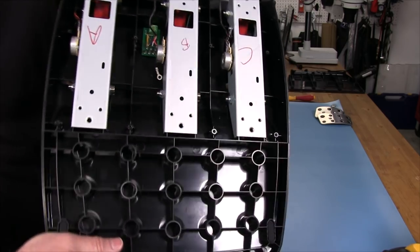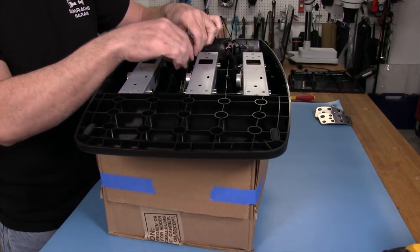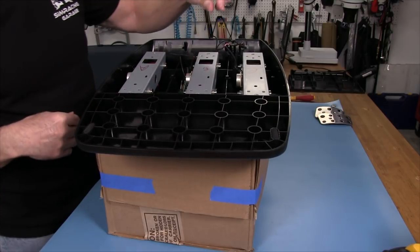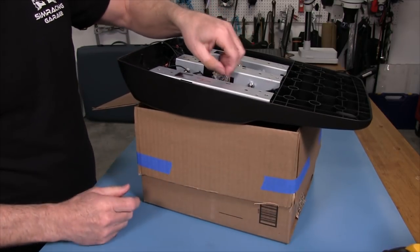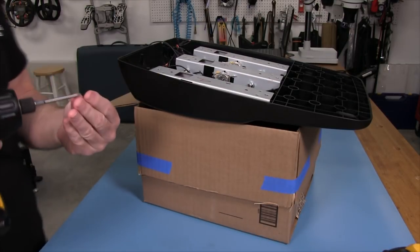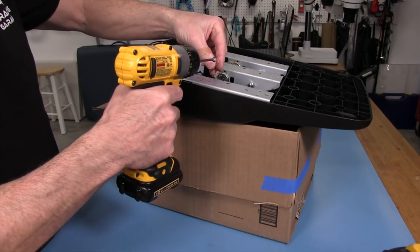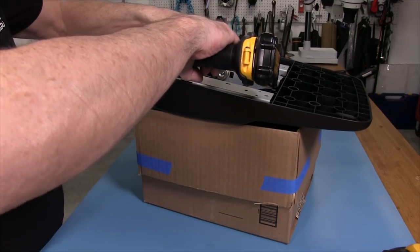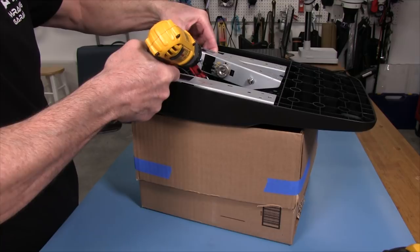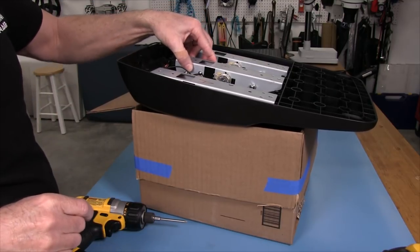The circuit board is mounted using double-sided foam tape — peel that off and stick it down in there past the little plastic rib. The wires still have to fit back into their looms before we seal it all back up. We still have to get our ground wire in — it goes up here into the metal casing. With the pedals loose we can pull back a bit to get the ground wire in easier. Screw the ground wire down — nice and stiff on there — and there we have it.